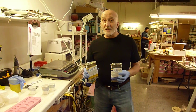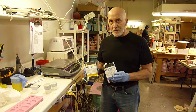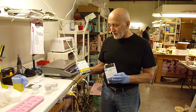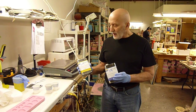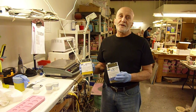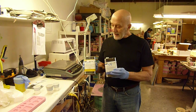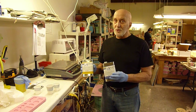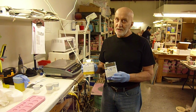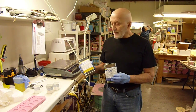Okay, we're going to do some clear casting today for jewelry, and this is a Smooth-On product. It's called Crystal Clear Series, and it's their product 200. Now, this is a great product, but like all these clear urethanes, it's very sensitive to moisture. And it's expensive as well. So you want to use it on a day that doesn't have a lot of humidity. Don't do it on a day when it's raining, and mix it thoroughly.